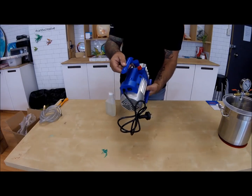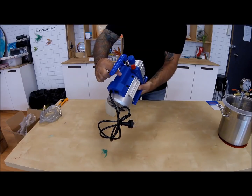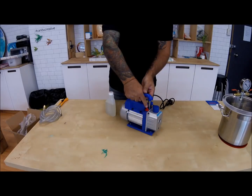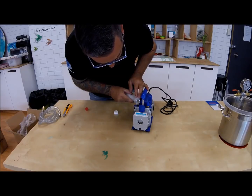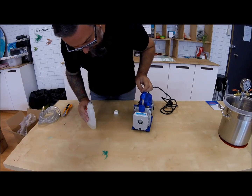There may be oil residue on the outside of the pump. The pumps are filled and run for quality checks before being emptied for transport. Remove the red filler cap and fill the pump with the vacuum oil. Replace the red filler cap. After replacing the cap, check that you have the correct oil level in the sight glass.